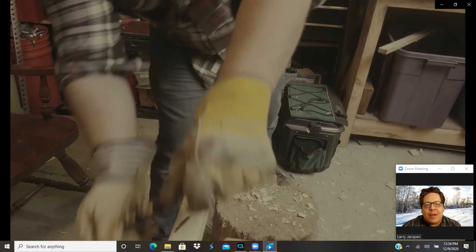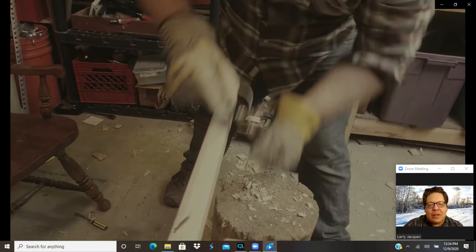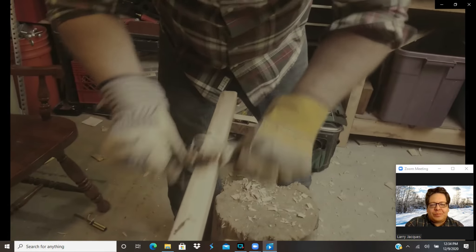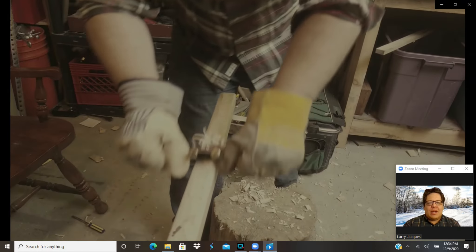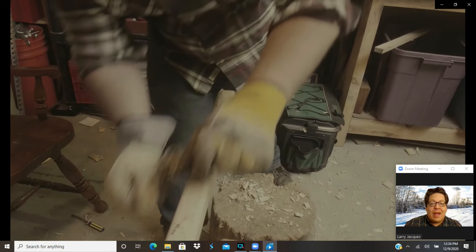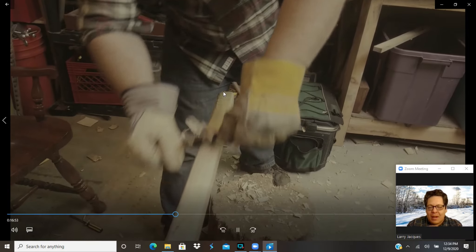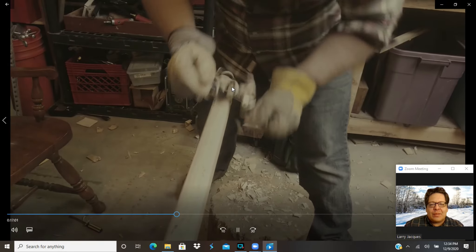Standing up, you've got to put your back into this. You're getting a lot of good chunks, a lot of material removed, and starting to get a nice shape on the snake. But the deal is, you can't always 100% trust that you're doing a level job. I'm new to spokeshave as well. Essentially I'm going forward and backwards, trying to clear the shave chamber — that seems to be working, and I'm getting quite a bit of material. I'm putting a little bit of preference on one side, and a lot of material is coming off. But ultimately, it's not making a very even surface, so we'll take a look.